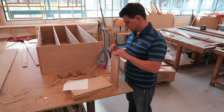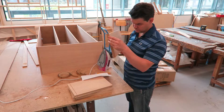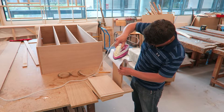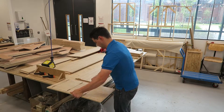This cabinet is made from oak faced MDF and what you'll see now is I'm just applying some iron-on edge banding to the cut edges. This is something I can trim down later but it really gives a nice finish. If you wanted a more robust finish you can apply 2mm PVC edge banding, but you'd need to route that out in order to get a groove to mount into.